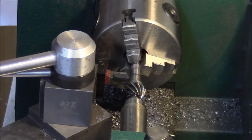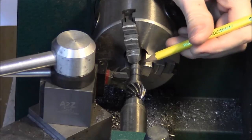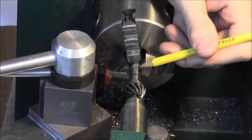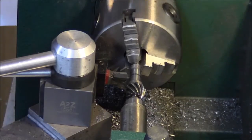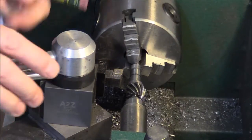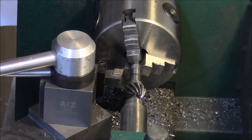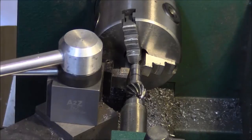Let's look at a couple of challenges on this particular turn. I'm turning up to the end of this dark line here, but I've got to go all the way up into this threaded area too and I may hit the chuck. I need clearance on both sides — I need to come up right up to shoulders on both sides because I've barely got a grip on it here. I'm going to turn up to this line using this tool, and then once I get some clearance I'll switch to this other tool which will let me turn up near the chuck. Between the two of them I should be able to blend together a workable diameter and then throw a die on it to get some threads.